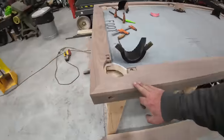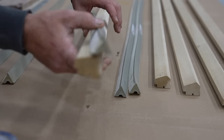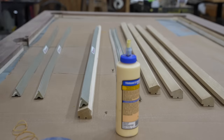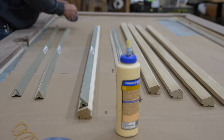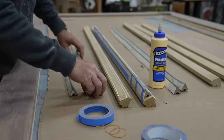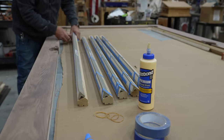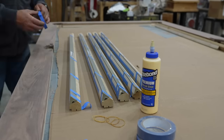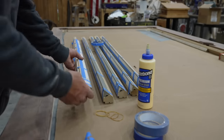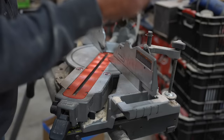There are many parts of the pool table that are made by other suppliers, and this is one of those. You get these hard rubber bumpers and this profile of wood — they get glued together, and here you see me using Titebond. That vulcanized rubber gets glued directly to that wood. These were all a little bit longer than the distance between every two pockets, so I had a very specific amount of material not to mess up.